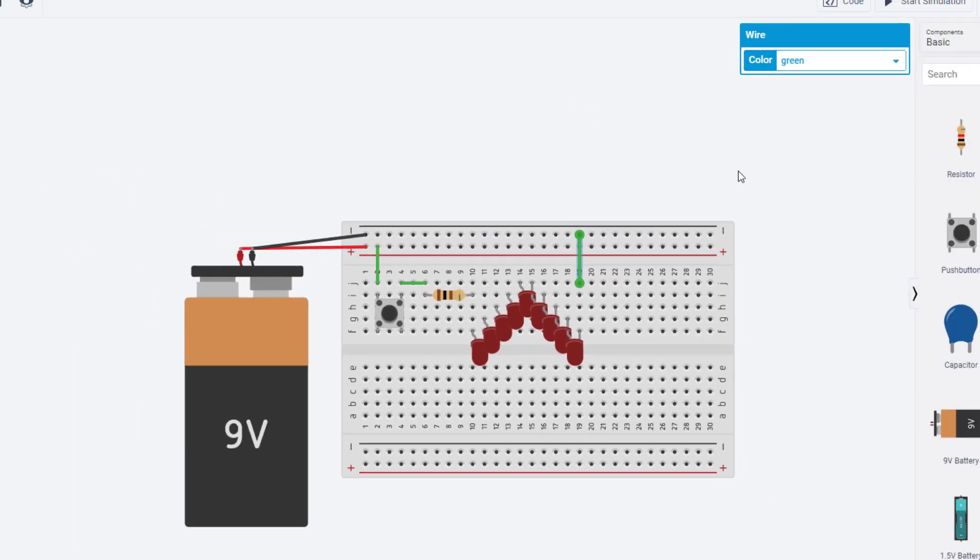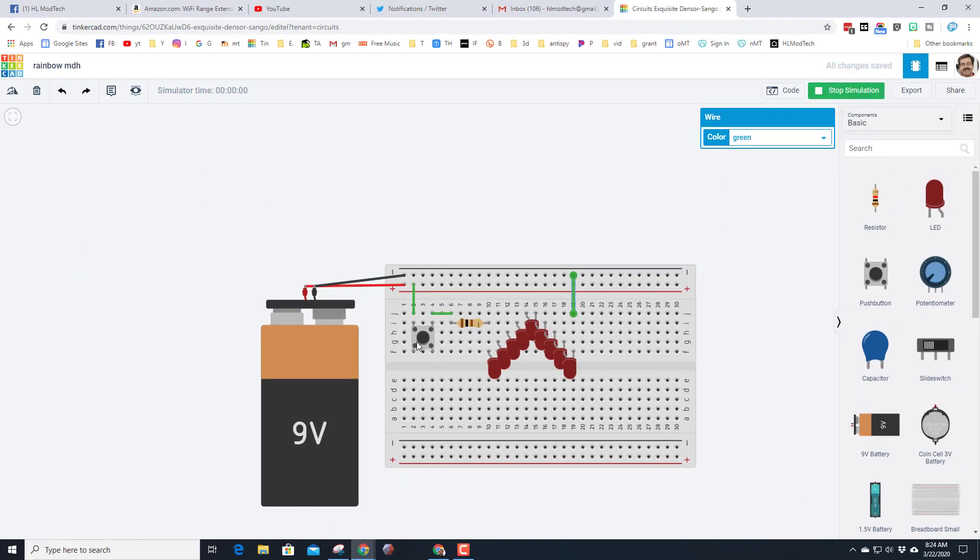They get kind of hard to see when they're down here. Connect the cathode of each one to the negative rail. This is the moment of truth — when you hit Start, nothing happens. What it is, is there is not enough juice to power all those LEDs, or we could have missed a row. We'll assume it's not enough juice and then back up and double-check for missed rows.